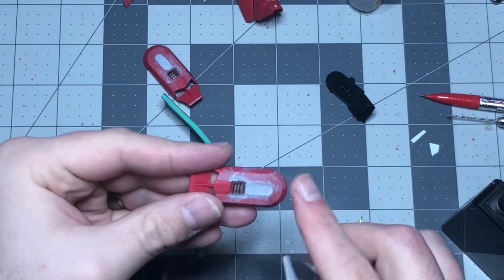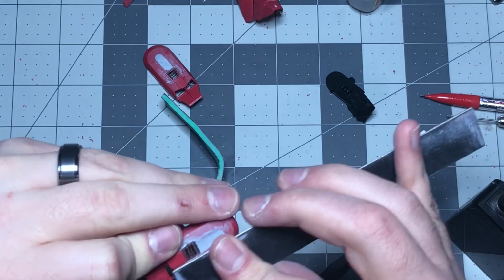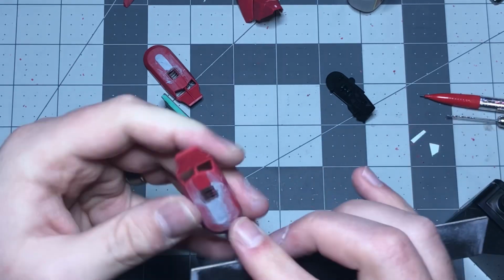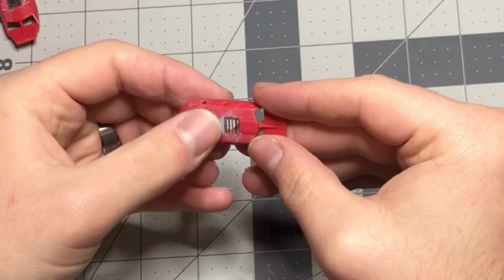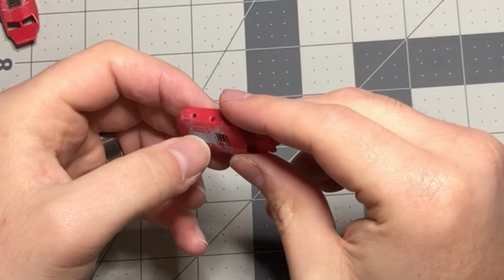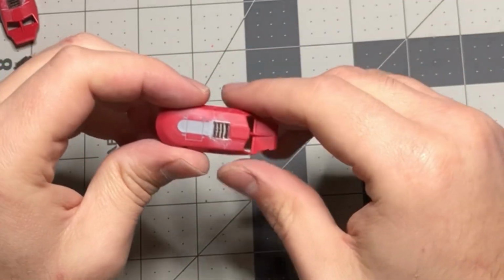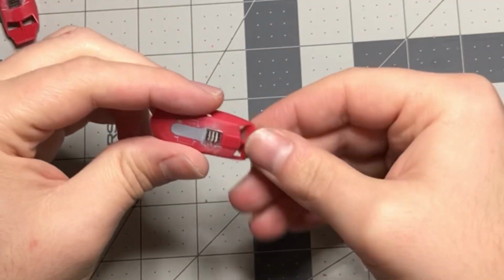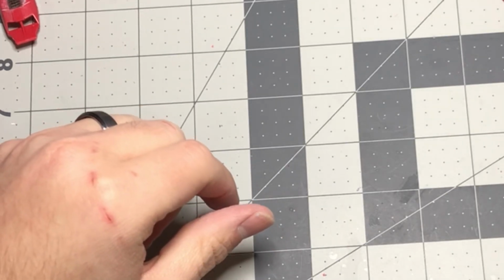The super glue is the same way. I only had to use a 600 grit on it. I don't think that I show that, but it's the same principle. Once it dries, hit it with the 600, smooth it out, and you'll be good to go. And as you can tell, it's a very smooth surface once you sand it down, and it dries hard to the touch, so you don't have to worry about anything. Once you put some primer over this, you'll never even know that it was here, and that's a beautiful part about this stuff. The super glue, same way.